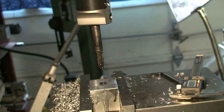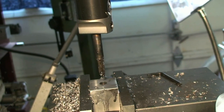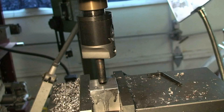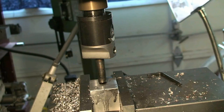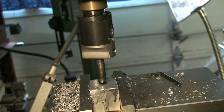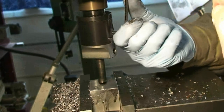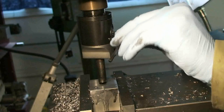So what we'll do is plunge the cutter back in — I'm going to put the cutter back in exactly where it came from. My DRO is telling me we're at a certain position, and I can feel pressure from the bottom of the mold, so I'm going to stop right there and lock it down. My DRO says we need to go two thousandths of an inch deeper, but I believe it's wrong. Now I will run the cutter out, back where we were just at, and we'll continue cutting.